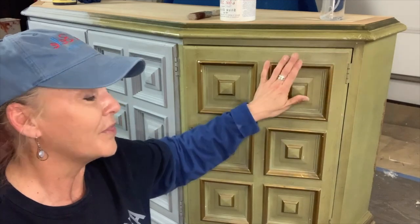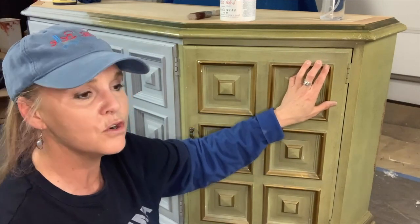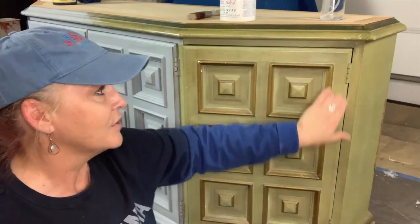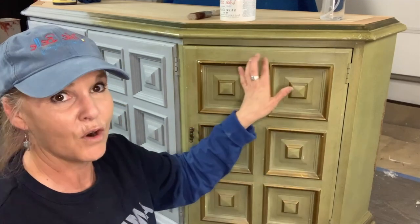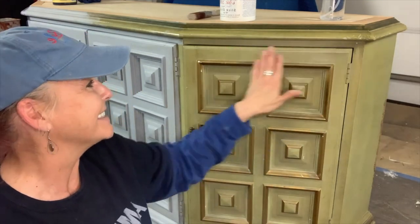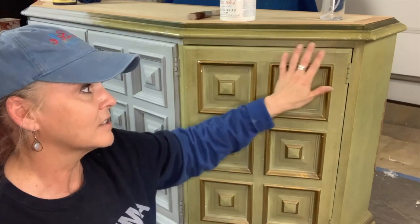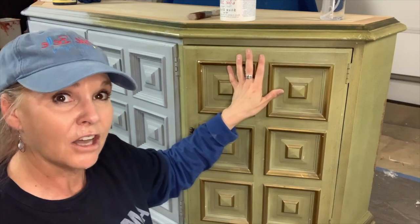It's a beautifully built piece, so I'm going to be putting slick stick on it. Slick stick is Dixie Bell's bonding primer. It's going to turn any slippery surface into a paintable surface — you're not going to be able to scratch this off. I'm using slick stick. However, it's gray — because slick stick is white, but I've tinted it. I'm going to be painting with In the Navy, which is a very dark blue.